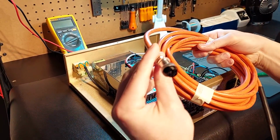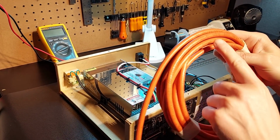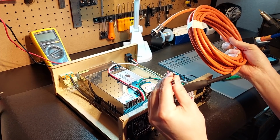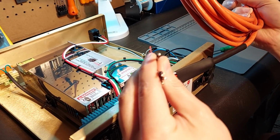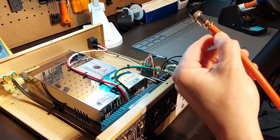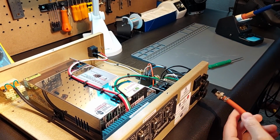That was built, and this is the GX16 6-pin. It's on a piece of DS Flexion 20-foot, 20-gauge 5-lead. Okay, you can see it right here. And you can see how this is set. All of these ferrules are not only crimped but soldered on. You can see on the ends, they're all perfectly soldered on. Okay, this has its shield drain attached to the 6th pin. This connector has been properly machined out in order to fit this cable, and you can see it fits like a glove. All this end user has to do is plug this in.